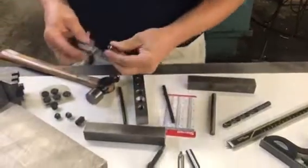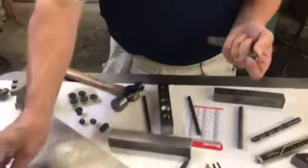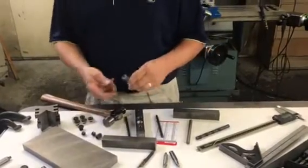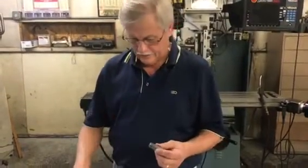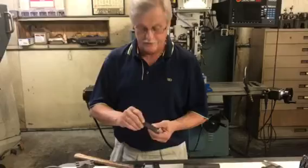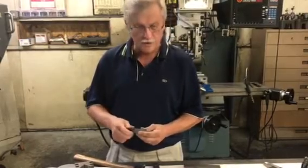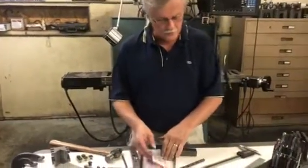These are unusual little things — you probably won't see them in a textbook. You certainly won't see the method of twisting and marking with your drill bit in a textbook, but that works. Sometimes you've got to improvise and figure out how to do things. All these little pieces — where do they come from? They're made by a machinist. These are lathe parts primarily, even the housing with the hexagon hole and all the screw inserts. They're made by a machinist, probably on a screw machine — a sort of lathe used for high production.